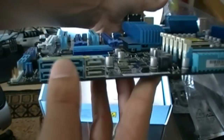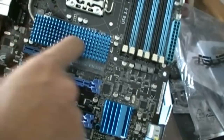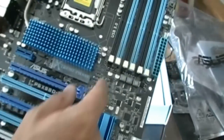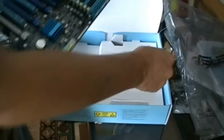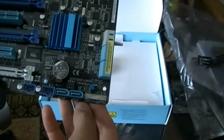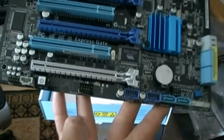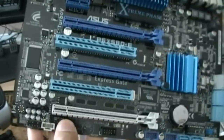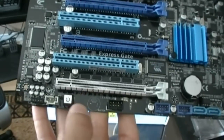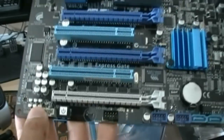Keeping going down — SATA 6 gigabits, regular SATA. Your North and South Bridge coolers. This one's pretty beefy and it's connected with the heat pipe to the VRMs as well, and it's got a little protective shiny thing — shiny is cool. You even got a cooler on the bottom here, that's neat. Got more SATAs, front panel plug-in, BIOS chip, battery, USB, USB, buzzer, Firewire, and a power button — that's cool. My X38 ROG board had the reset button as well, that was pretty awesome — first board to have all these cool features.